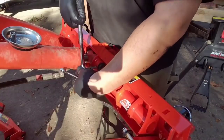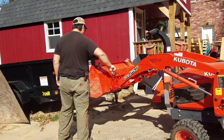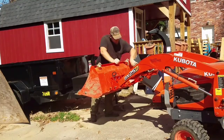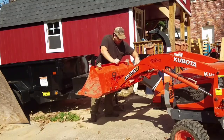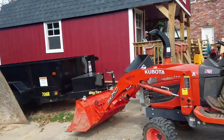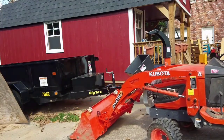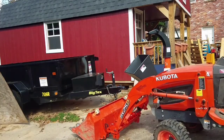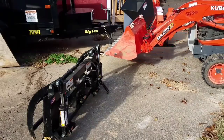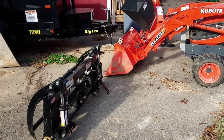Here's some video footage of it being used. I'm pulling the pins out — I've already attached my bucket and I'm getting ready to drop it. I pulled the keeper pin out, pulled the main pin out, slipped them into the little spot on top of the quick attach, and then dropped the bucket. As it turns out, I had a little 4x4 block in the bucket that dumped out, so I was laying the bucket down on top of that block — that's why it was sitting funny. Here's another shot of dropping the bucket when there's not a block underneath causing it to go off kilter.